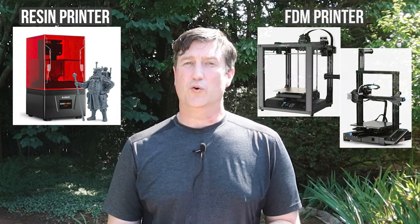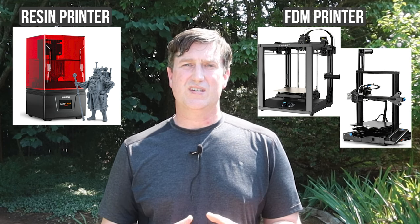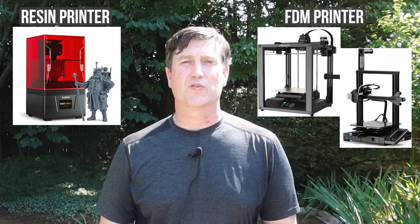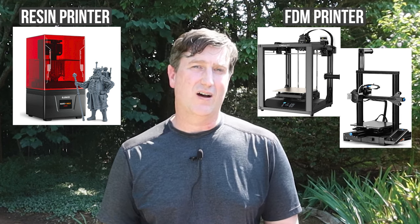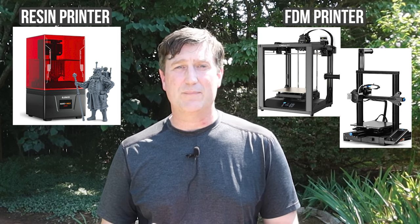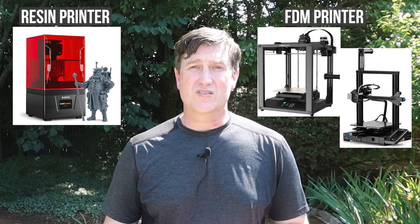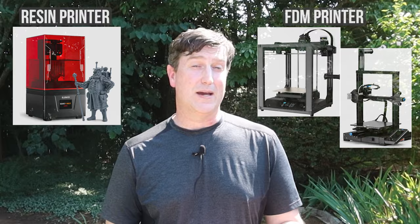Let's talk a little bit about how 3D printing works. There are a handful of 3D printing technologies out there, with the two most common being resin-based and FDM. For our hobby, you're going to want an FDM printer. Resin prints in finer detail but is more suitable for people that want to create very high detail, non-load-bearing objects. If you're interested in 3D printing for creating replacement parts or adapters or customizations for different types of objects around the house, you want to start by looking at FDM printers.